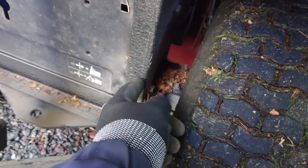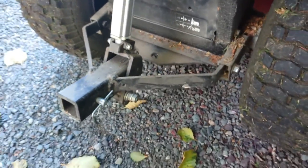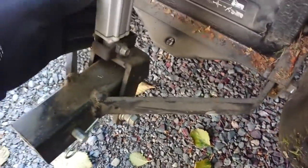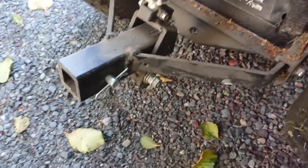it's got this angle iron made from old bed frames, just to anchor that up there, because these are pretty strong, but with this bolted to it, this is super strong. It's not going anywhere. And in case you're wondering, this just pivots loosely, so if I hit a rock or something, it's not going to destroy this. Oh, that was the hope. It seems to be working pretty good.